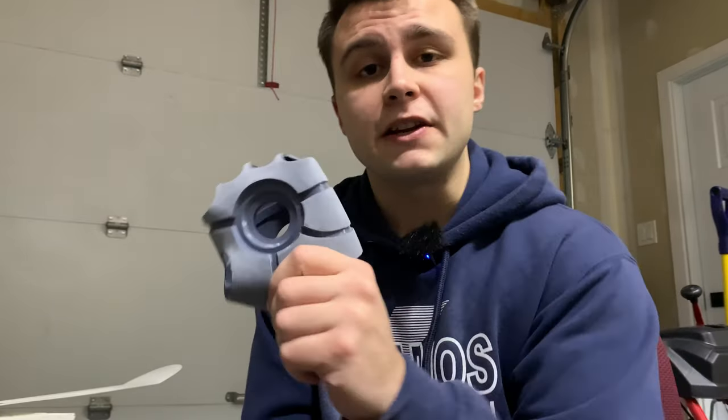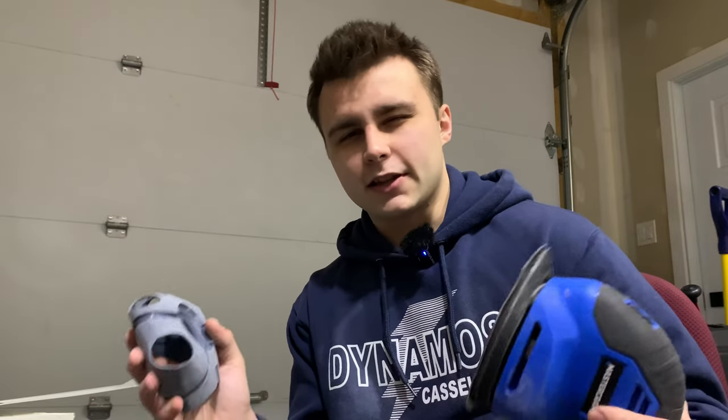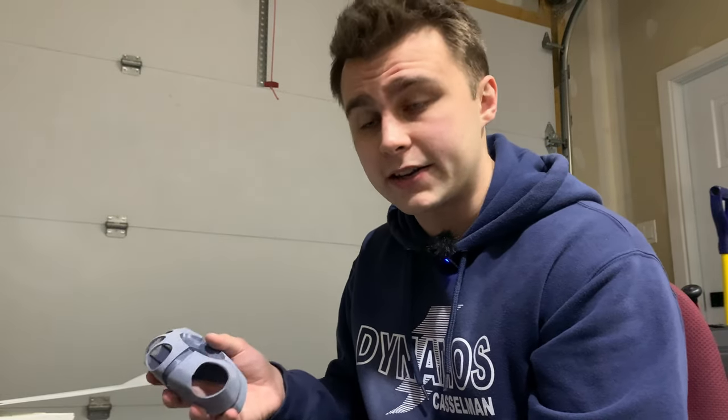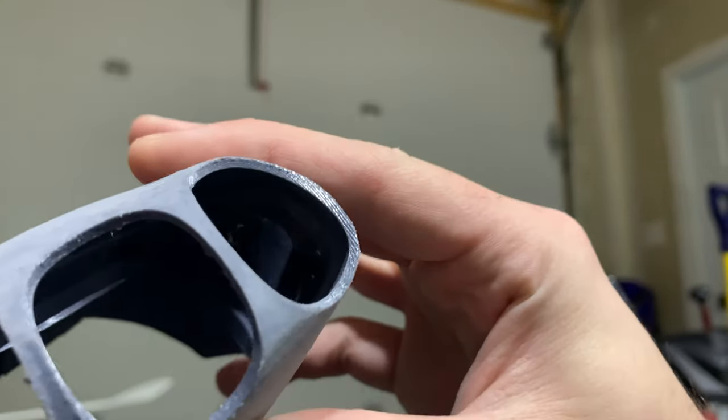All right, I'm back. Before I finish sanding with 120 grit, here's one quick tip. When 3D printing a part at a really steep angle, you'll see an effect called stair stepping — where each layer progressively stacks on top of each other like steps to a staircase. With an orbital sander, spend a little extra time on those stepped areas until the plastic starts to get hot. As it does, it'll start to fuse those steps together, creating an even transition across them.